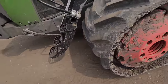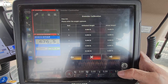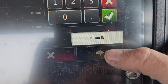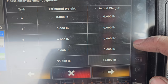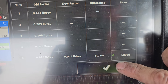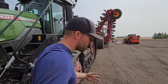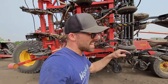Always run like a banshee back to the tractor because we always want to make as much time as possible. So then we're calibrating - you pop this over. The cart thinks that it did 33.5 and then we put in the correction, which was 30.8. It was out 8%. You save that or you do the process all over again. We're going to do the process all over again. You might ask, why? Surely if it was within 8%, maybe it got it down to 3%. But I want to save it when it's like 1%.